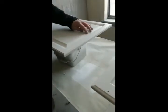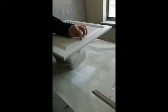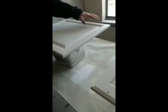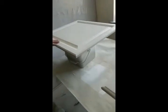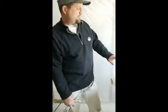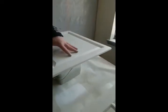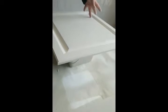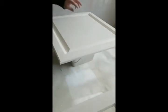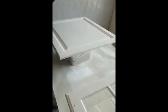The main reason is that the Gemini doesn't have the adhesion to some of the existing varnish that was on there. So even though we sanded the varnish down for mechanical adhesion, I need a chemical adhesion — and that's where the BIN came in. I grabbed the Gemini undercoater that Jay Donnelly left me. When I back-brushed it and got back into it, it was still workable, if that makes sense.